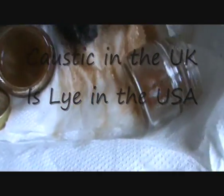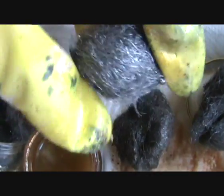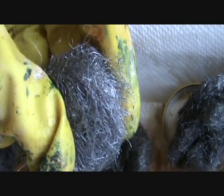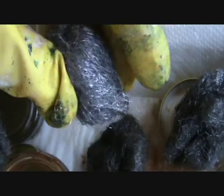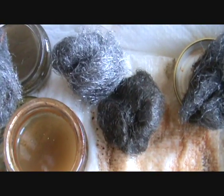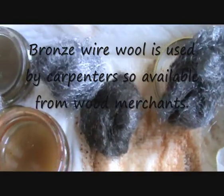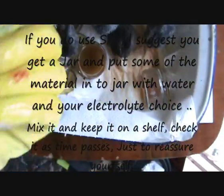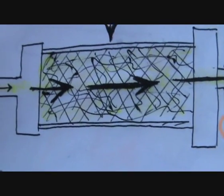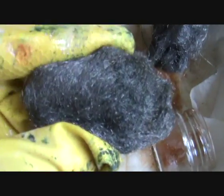So your choice in wire wool — I would suggest it shouldn't be steel wool. Go for a good quality stainless steel, and if you're buying those stainless steel wire wool kitchen scrubbers, there's a 99% chance it's coming from China and it'll be a very poor quality stainless. The only thing you should actually use, to be honest, is bronze wire wool, because it doesn't rust, doesn't disintegrate, and doesn't rot. Whenever you put something like this together and it's going to be shut off and not seen again for years, choose very carefully what you put in — it's good to have longevity.